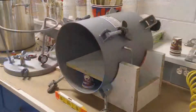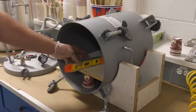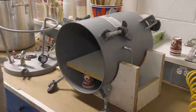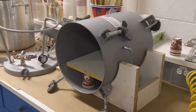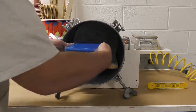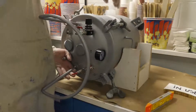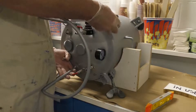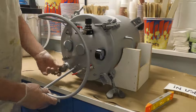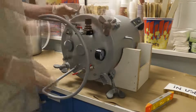After a quick visual check to make sure we have no leaks, the first half of our mold can go into the pressure pot to cure fully. To fit the mold inside, we put the chamber on its side with a leveling board, which allowed a much larger mold than would be possible with the pot standing upright. When putting the lid on the pressure pot, it's very important to tighten the bolts in a cross order — top right, then bottom left, then the two opposites — to prevent any air leaks once you pressurize the tank.